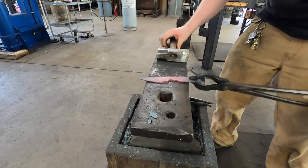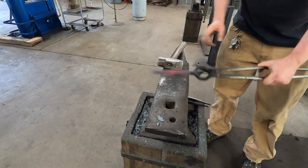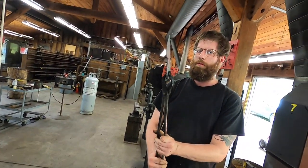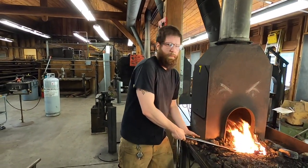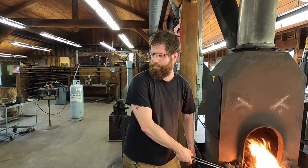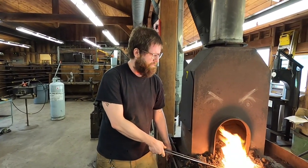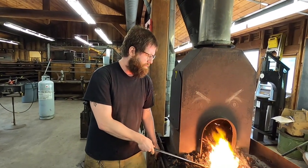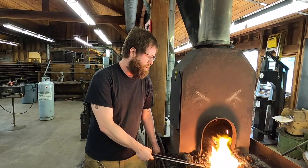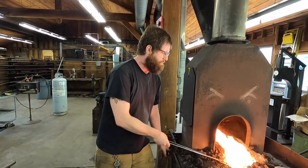That's a little bit better. Yeah. Okay, now I'm gonna use the wooden mallet to true it up and we will be finished. I use a wooden mallet for this stage because all my hammer work's done. Normally even after truing something up like that, I do another pass of the flatter just to be sure everything's nice and flat, but it's very close. And when you use that wooden mallet, you aren't adding any extra divots to the blade.